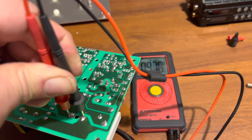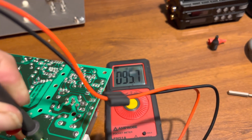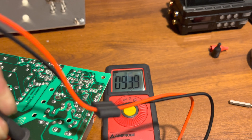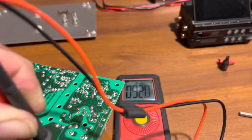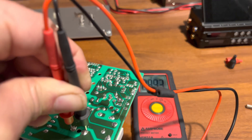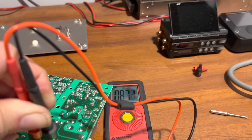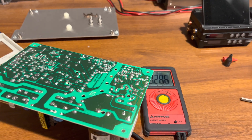Here's the reason why you always want to make sure your capacitors are discharged when working on a power supply. As you can see, it's unplugged and yet it still has quite a bit of DC voltage on that main filter cap even after a few seconds of unplugging — sometimes it'll last minutes. Always make sure you discharge your capacitors to ground before handling the power supply, so you don't end up giving yourself a good shock.